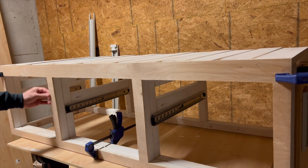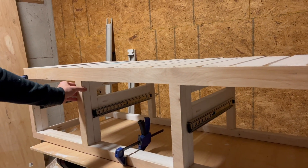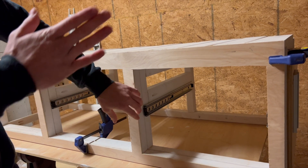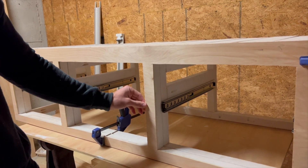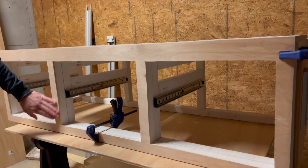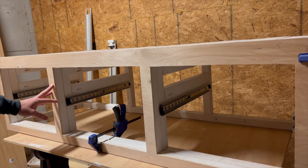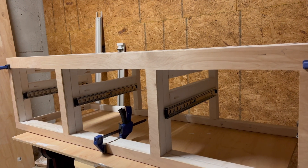We have our face plate cut out. I won't say it's my best cutting job ever, but it got the job done — the lines are pretty straight. We're going to sand it to smooth off any wobbles from the jigsaw and any slight wood chips. Then we'll prime it and possibly use it as a template for the drawer faces before mounting it.